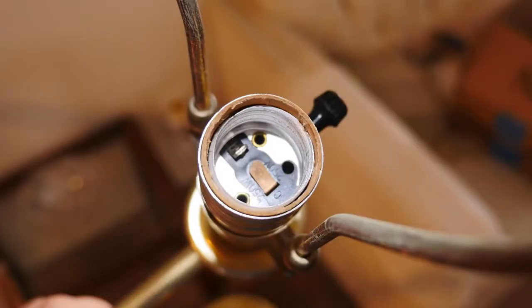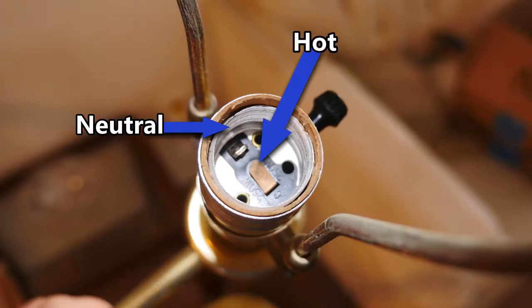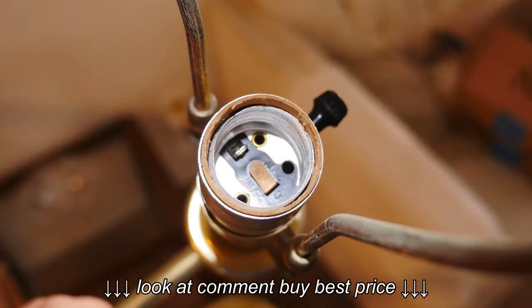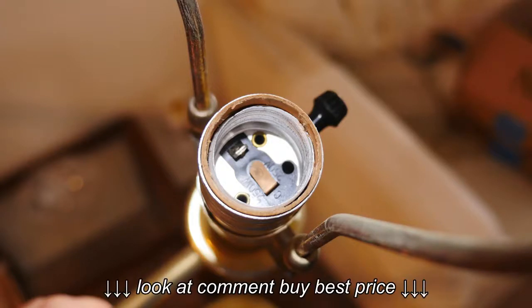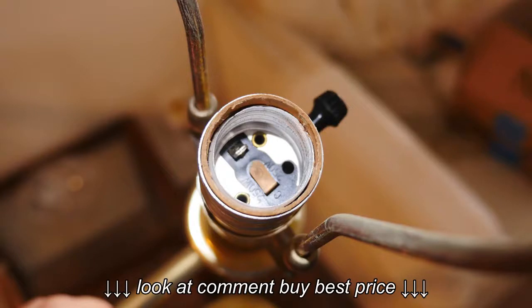To give you a common example, let's examine this light socket. The tab on the bottom of the light socket is supposed to be the hot terminal, and the side of the light socket where you screw the bulb in is supposed to be your neutral terminal. If you plug your polarized plug into a reverse polarity receptacle, all of a sudden the tab is now your neutral terminal and the side where you screw the light bulb in is now your hot terminal — and this increases the chance of shock. The light will still go on, but now there is increased danger for the users.